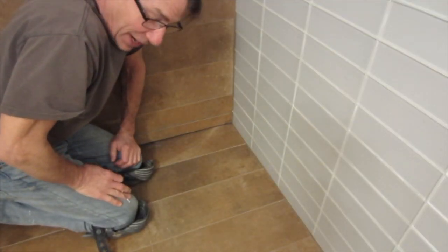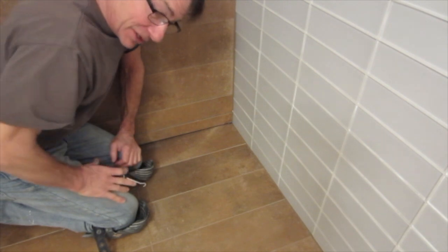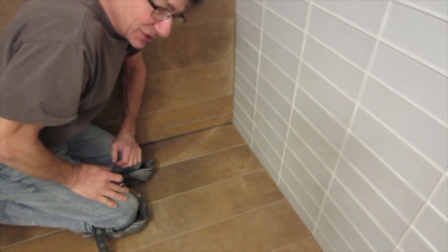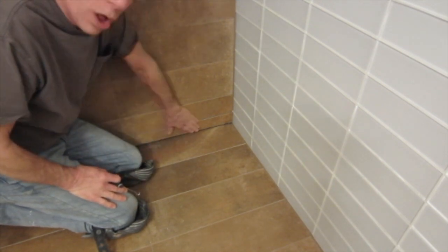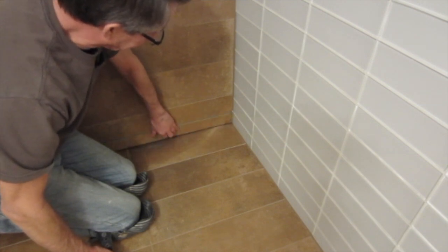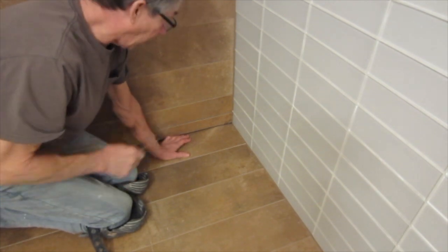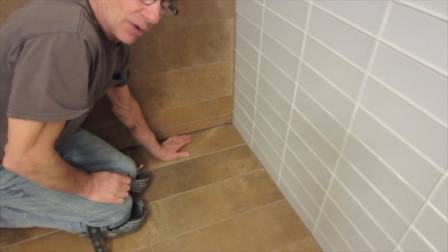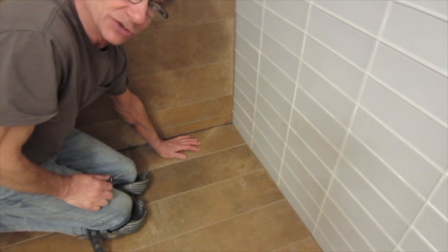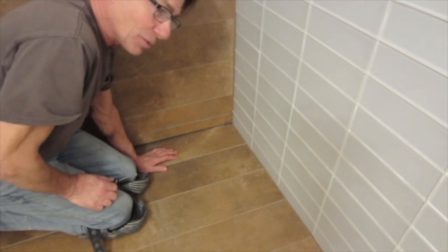I'm sorry — I didn't realize the camera had run out of battery there while I was videoing that. While I'm talking the praises of GoBoard, you get the idea of what I was saying. I also specialize in linear drains, and this is the wall drain from Quick Drain USA. The bottom course of tile sits three-eighths of an inch up off the floor and the water goes right underneath the wall. I have many videos posted for Quick Drain USA for their shower line drain, pro line drain, and all their linear drains. Look for Steve Tattersall on YouTube and you will see all the videos of drains and GoBoard. Thanks.